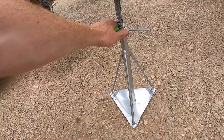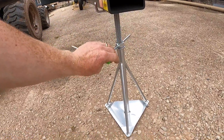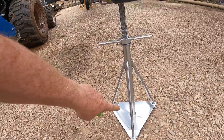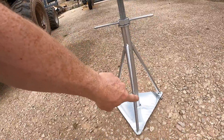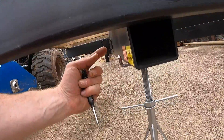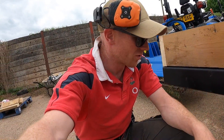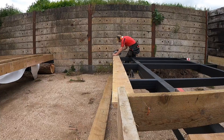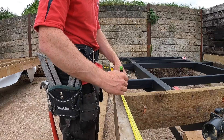These are intended to take the weight off the wheels once it's sited, so we'll actually have about 10 of these per chassis. For now we've just got two at each end. These will also help with our idea that if our whole insulation layer is floating this high above the ground, you've got to be a very, very good mouse to somehow get up to the membrane under there. So by going this route rather than conventional concrete blocks or anything like that, it's kind of another way of making sure we're rodent proof.